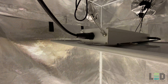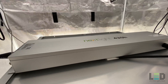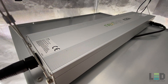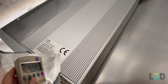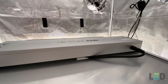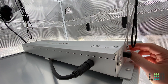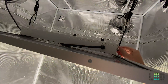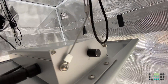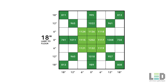The 420H draws 420W at the wall — 3.5A at 120V and 1.75A at 240V according to Nexlite's specifications. When I measured the watts and amperage at 114V, I got a reading of 427W with an amperage of 3.72. The auto-sensing driver will accept voltages up to 277V AC. Expect a heat output of 1435 BTUs per hour from a single fixture. The light is IP65W rated and CE certified. Since this is a home grow series, there is not a DLC or UL listing, yet you still get Nexlite's 5-year manufacturer's warranty.